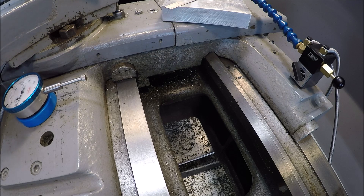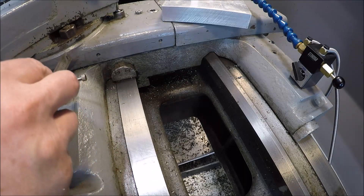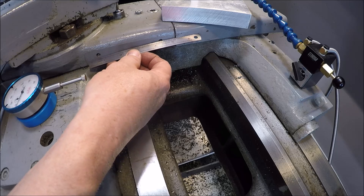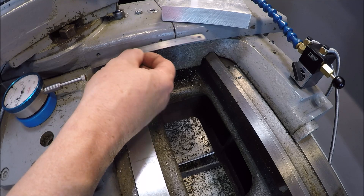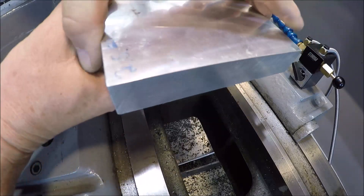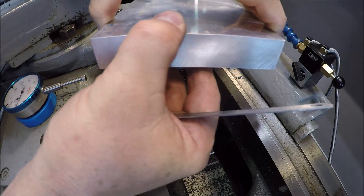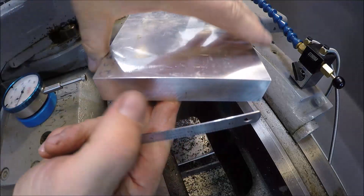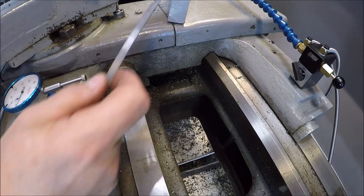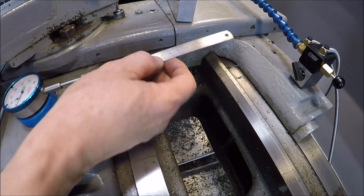Since we're designing this on the fly, there's a bit of a change of plans. We don't have to mess with that radius — I think we've got enough travel if we run a five-inch piece of aluminum. I've got this block right here that'll work out perfect: five inches wide and just under an inch — about 0.988 — but that'll be fine. I'll go ahead and get this thing cut into two strips, then get over to the mill and start milling that dovetail.